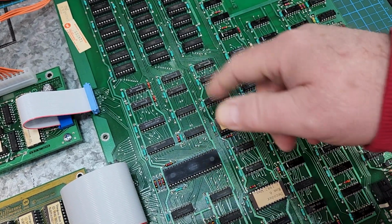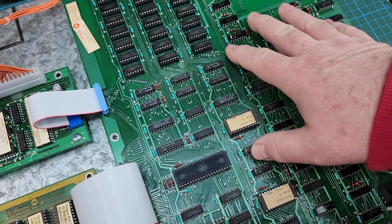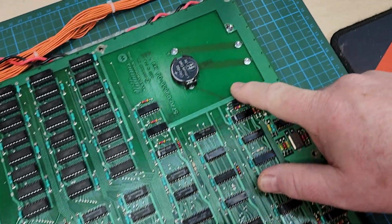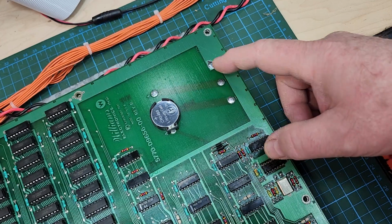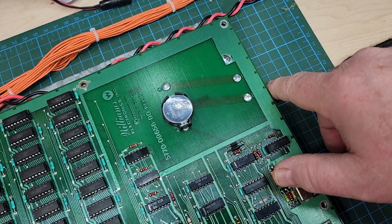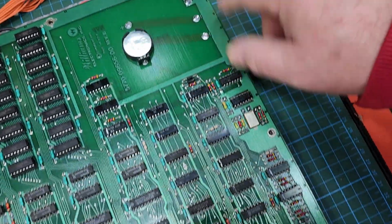On the Rev C and D and future boards, they put some pull-up resistors. There was a version of the B that had a little plug-in daughter board that went here, so I provided that mod on the back. We took your old CR2032 battery holder off, and the head jumper on the front, cleaned it all up, redid all this. And you have a CR2450, which has about 3 times the capacity, so it should last much longer than the 2032s. Clean the whole board.